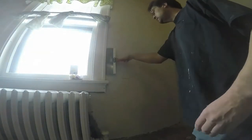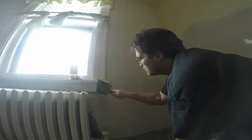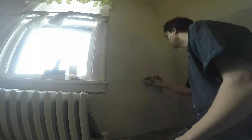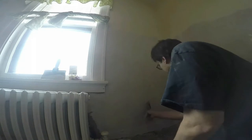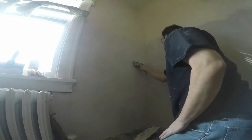You can use plaster washers, or here I am just fixing the holes. We use tape to reinforce the patches or to reinforce a crack — we always have a means to fix our plaster. I'm probably working on the second coat down here.